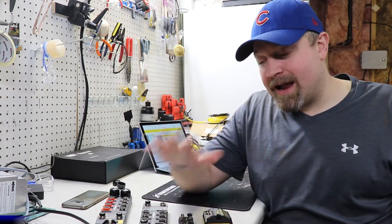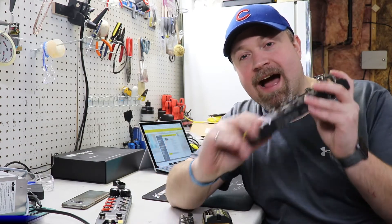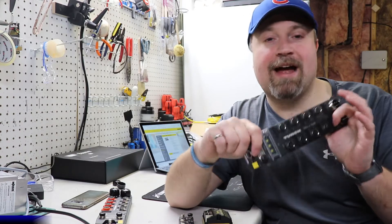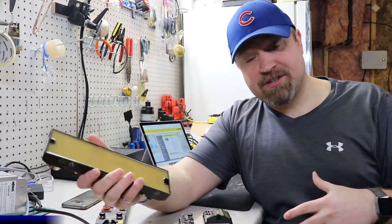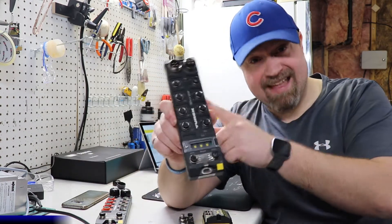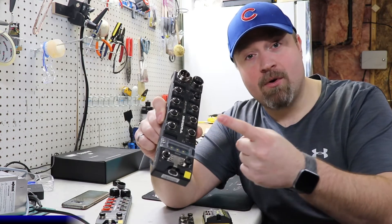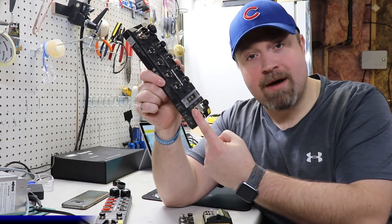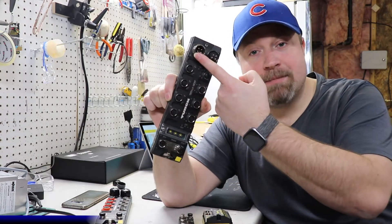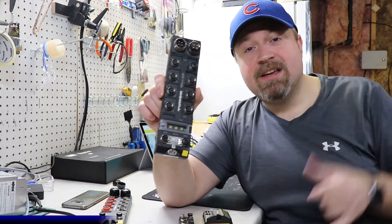Today we're going to be talking about multi-protocol I/O for Ethernet. I got a couple of products today from Turck, and the first one is our T-Bend Block series. This is a fully potted IP65, IP67, IP69K device that's designed to be machine-mountable on your tooling or on the side of the machine. You're going to run all of your remote I/O into this device. I have M12 connectors here where I can run either field wireables or Y-splitters into this device, and then I'm going to run my Ethernet back to my switch or my PLC and my power back into my panel. If I want more I/O, I can simply daisy-chain off this device and continue to move on.